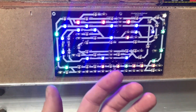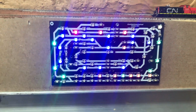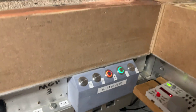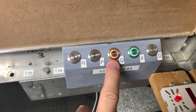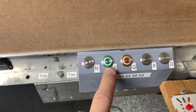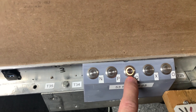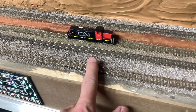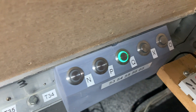All this information is also going to JMRI, so you can trigger it there and trigger it here. I have some individual switches on the side here — red, green, and yellow RGB. This one is red. I select the route. Now it goes to yellow because it's selecting the route and there's also a locomotive there. If I move the locomotive off the track, that guy turns to green.